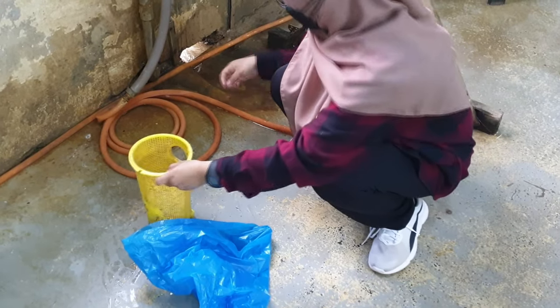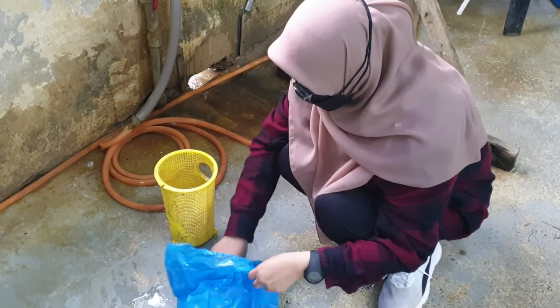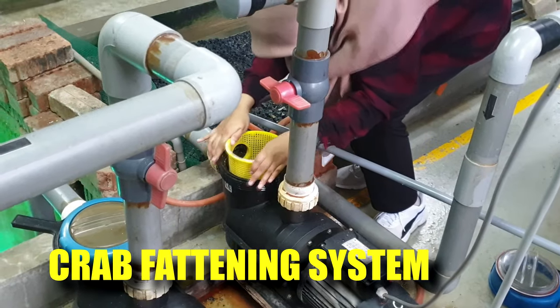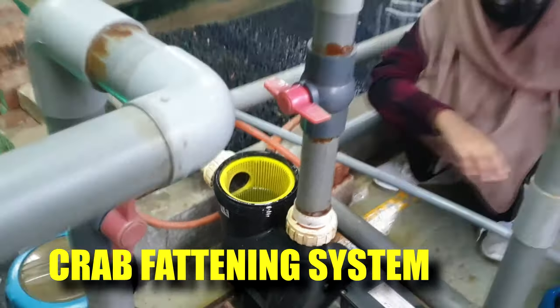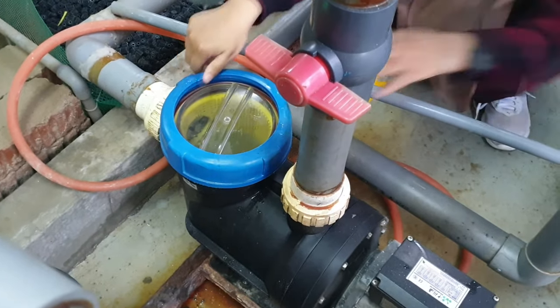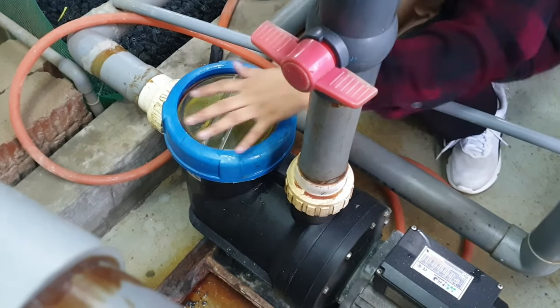As you can see, most of the solids being trapped in the strainer baskets are things like fish bones, which tend to be leftover feed or waste from the crab farming system. It is important to clean out the strainer on a weekly basis to remove any trapped solids so that you have a highly efficient pumping system that can pump fluid through the sand filter without much pressure loss.